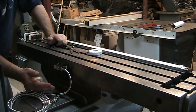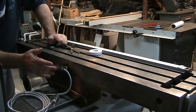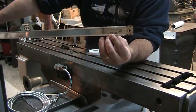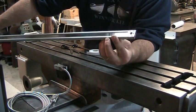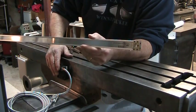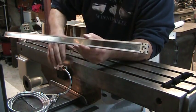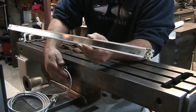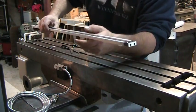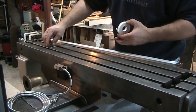You'll see the cord coming off this side. I'm right-handed so I plan on having my readout on the right-hand side of the machine. What's important — as you'll see in the installation videos — is that on the magnetic slide there are a series of striped lines, and those lines have to line up in the same configuration as the reader head, otherwise the reader won't be able to accurately use the scale. So the reader head will have to be reversed so the cords flow off to the right-hand side toward the back of the display.